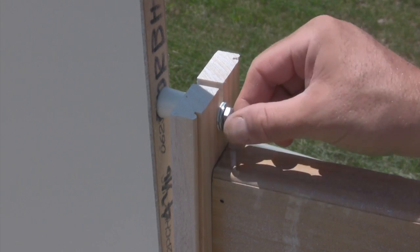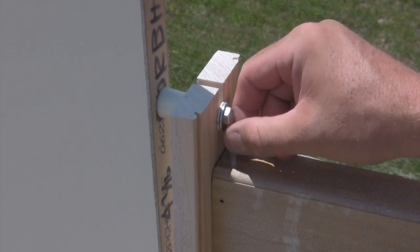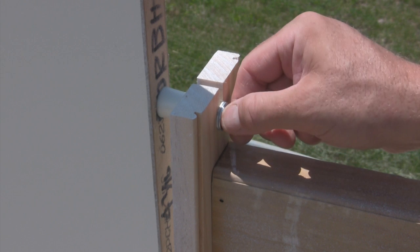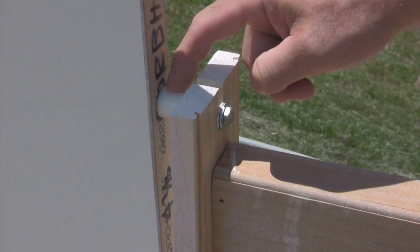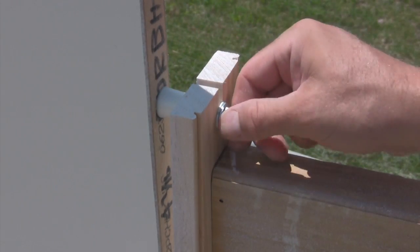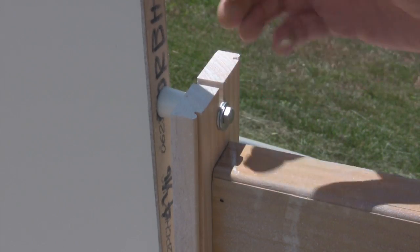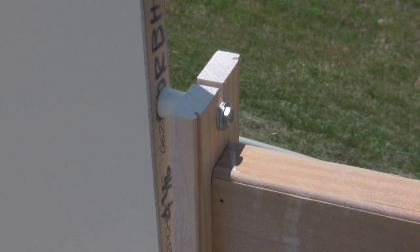on your little jig that you've made up. And once you've laid it in place, you can go ahead and tighten up, not real tight, just snug up your lag bolt. So you can see what that grommet's doing. That grommet's just giving you a little bit of space between your jig and your door, and it's giving a little bit of a bumper to keep everything in line.